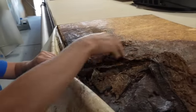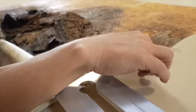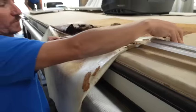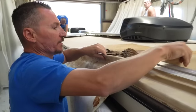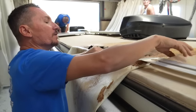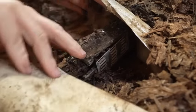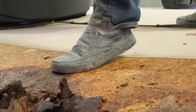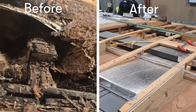It's like garden soil. So as you can tell, you're at the mercy of the glue. Once you get the EPDM or the TPO, it's water-based underneath. Once the water gets to it, it automatically just starts delaminating the whole roof. A telltale sign is if it turns white underneath your rubber — you've got major problems already. See how it's split in the middle? The whole roof is now collapsing in the middle. So we went from a two-day job to a one-week job.